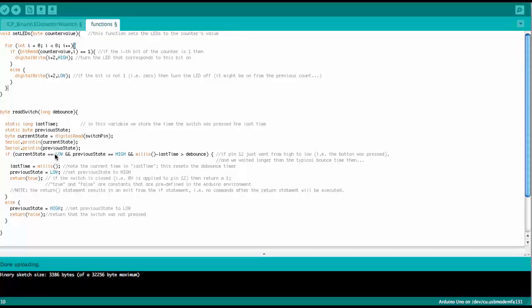Okay, so if the current state is low, that means the switch is pressed. Remember, we make a short circuit to ground on this pin. And the previous state is high, so that means the switch wasn't pressed right before we read here a low. And 200 milliseconds have passed since the last time a low occurred. Only then do we actually go into these statements here